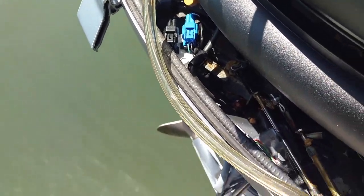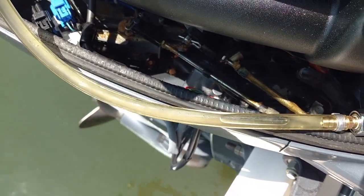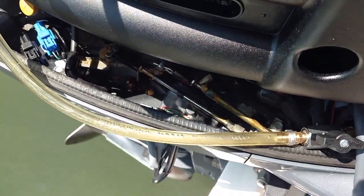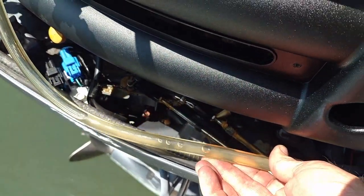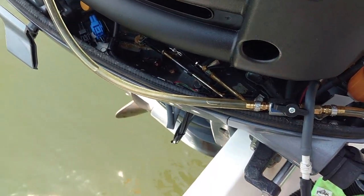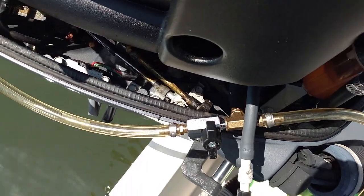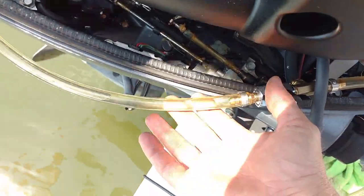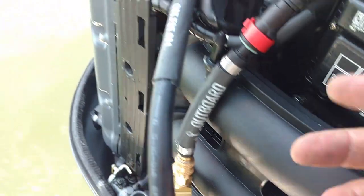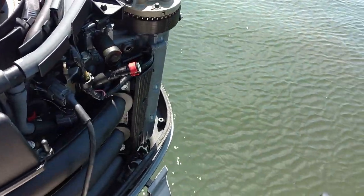One last sample and then I'm going to shut it off here so I can actually look at what's coming out. It's still a little cloudy — I'd rather see it not cloudy at all, there's just a big old blob of water in there. One nice thing about this tubing is you've got good clean fuel in there, you can see right through it, pretty much clear as a window. I'm going to pull one more sample here off the starboard rail and then jump over and do the same thing on the port side. Much better fuel coming through there now. I'm going to go ahead and cap this off, shut this off, and then disconnect here and put the high pressure feed back onto the starboard injector rail.